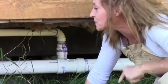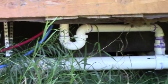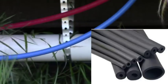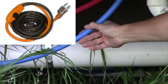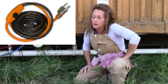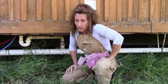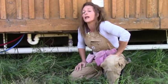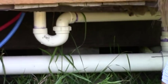This building has been here a while, which is why I have all this grass in the way. Assuming you have everything underneath your trailer completely sealed, you may also need foam pipe insulation — it's almost like a pool noodle material that goes around your water pipes. They also make heat tape you can wrap around your plumbing if you feel like your skirting might still let in drafts. The biggest dilemmas with skirting are: number one, critters getting underneath and into insulation under your trailer, and number two, drafts — even the tiniest draft can cause your pipes to freeze.